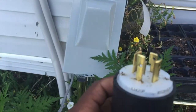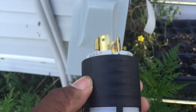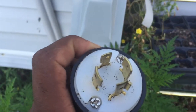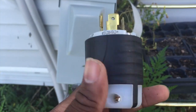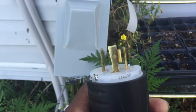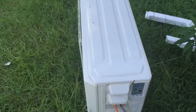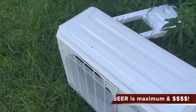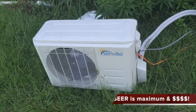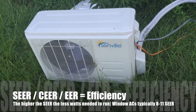I've already wired it for a 240-volt generator plug. I have a couple of generators that we use out here — this one right now is rated at 20 amps. The other one is rated at 30 amps, but the 20 amps are actually running this one pretty well because this is our 25 SEER AC. It runs at about 1,000 watts full load. The majority of the time it runs at about 600 to 800 watts, so the system I'm designing will run this fairly well.